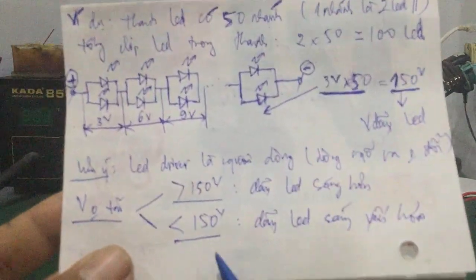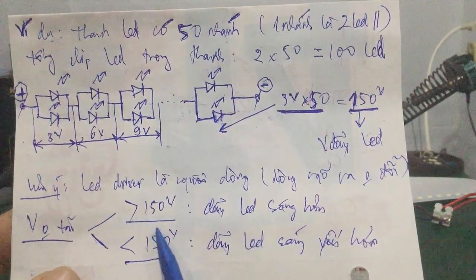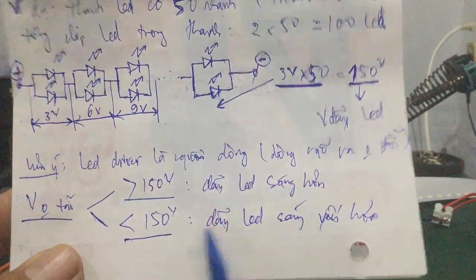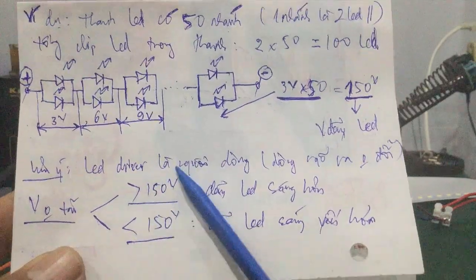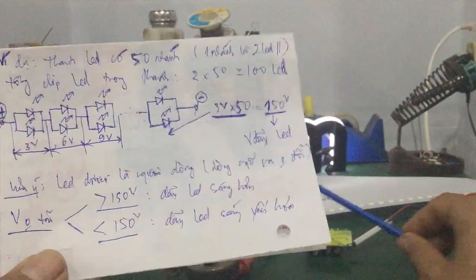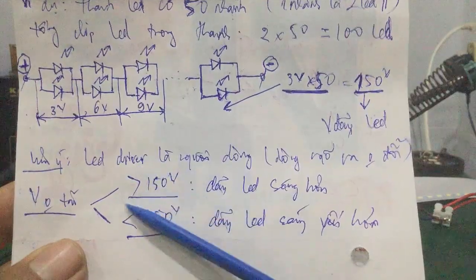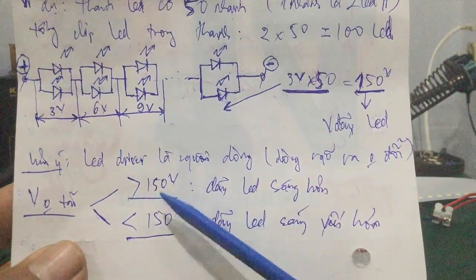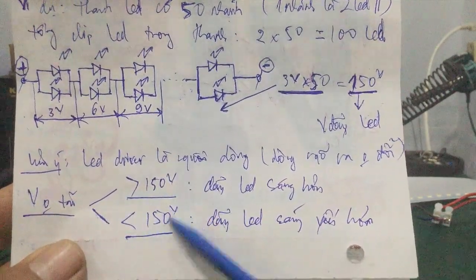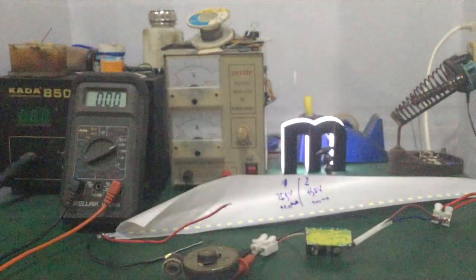The voltage of 130V is below the calculated required level of 150V. I mentioned this in constant current mode: the voltage is below 150V — we will see what happens. But the current is still within the allowed range, still greater than 100mA. Due to voltage drop on the LED chips and the copper traces on the board, the voltage gets pulled down when the load is connected.